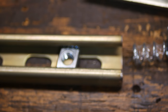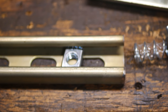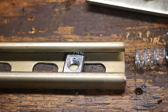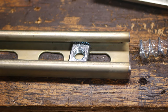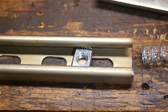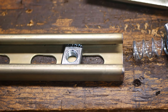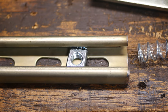We're going to put these ends on and then hold it up to the ROPS. We'll mark the hole, hit it with a punch to center it, and then drill the holes through the ROPS. Now, I know some of you guys are going to completely lose your mind when I drill through the ROPS, but this is my choice. You need to know it's going to void the warranty on your ROPS and could void any liability coverage — but this is America, baby. I live the way I want to live, so we're going to get this bolted up.